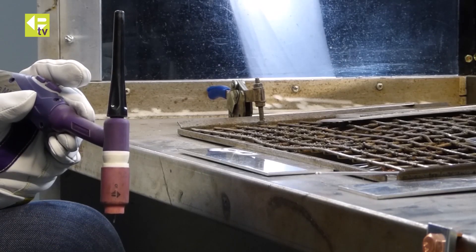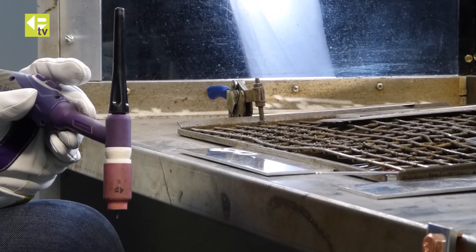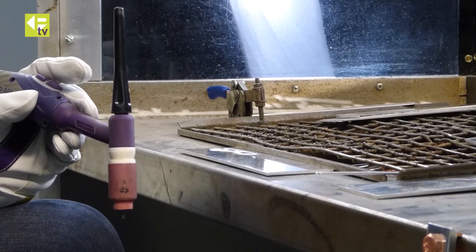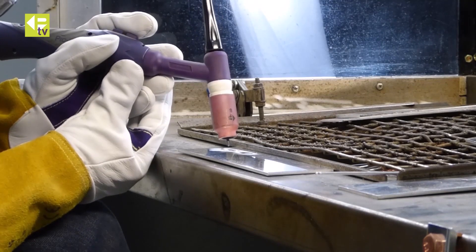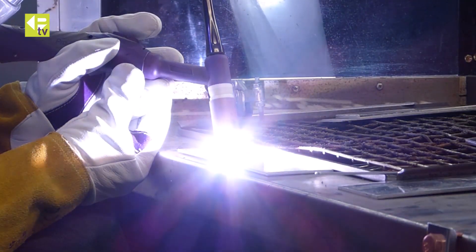What I'm going to do now is change the AC frequency. We're on 50Hz and we're going to go up to about 100Hz — we'll see the tighter arc and the improved heat input. Here we go, 100Hz. The improvement is clear through the fill.